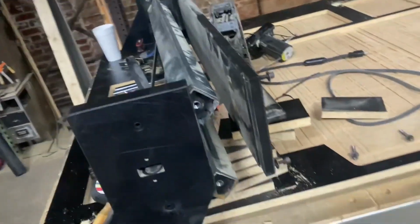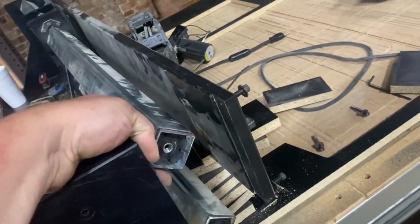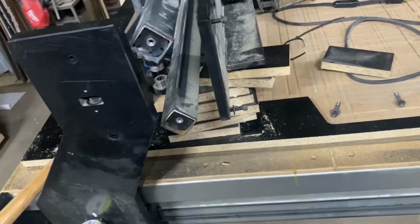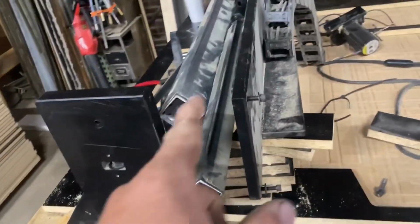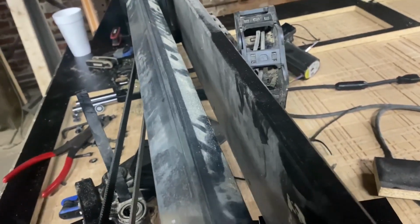Okay, y'all, there's no turning back now. I got this thing. It's got enough wiggle in it where I can push this runner forward. I'm going to pull these out, snatch them out, turn them 90 degrees, and slide them right back in. So basically, taking this top edge and moving it around to the side, so I'm going to put my new running edges on the top.